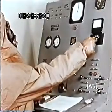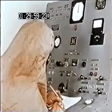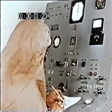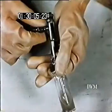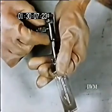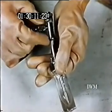He also measures the temperature and humidity of the air in the system. He checks especially that the system is under a negative pressure. As a safety precaution, the main valve in the compressed air is closed while the aerosol disseminator is being lowered into the center of the sphere.